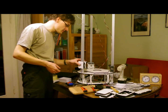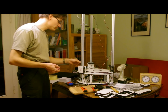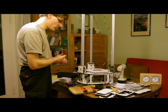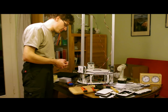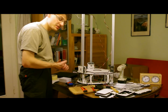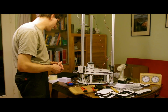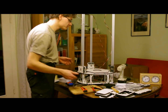The carriages here are mounted and they work all very well. This was pretty easy. I only confused on one of them the sides of this plate, so I had to disassemble it again, but it wasn't really a problem. I had only one minor problem: I don't have the proper inch-type Allen keys for these screws. It's I think 7/64 or something. I have a set of inch-type Allen keys, which is probably rather rare here in Europe, but this one was not in the set. Fortunately I found a fitting bit — it's almost like a Torx bit, but it works.